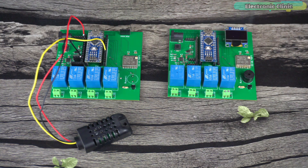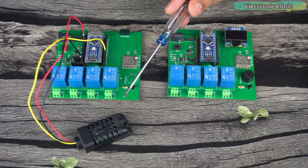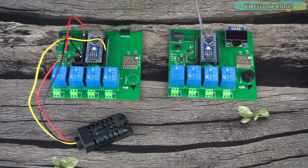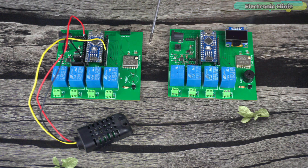For demonstration purposes I'm using this board as the transmitter and this board as the receiver. On the transmitter side I have connected the DHT21 temperature and humidity sensor, so I'll be sending its values to the receiver side where the temperature and humidity values will be printed on the OLED display module. You can download the circuit diagrams and programs from the article available on electronicclinic.com — I have added a link in the description.